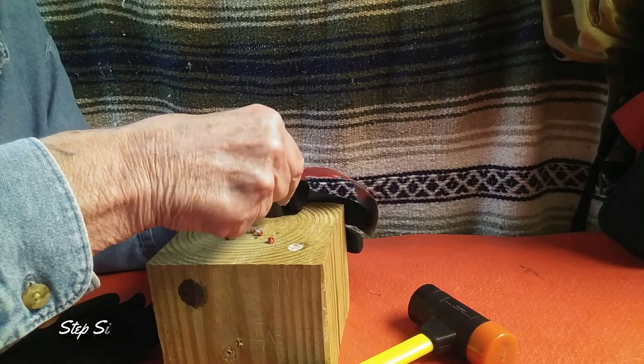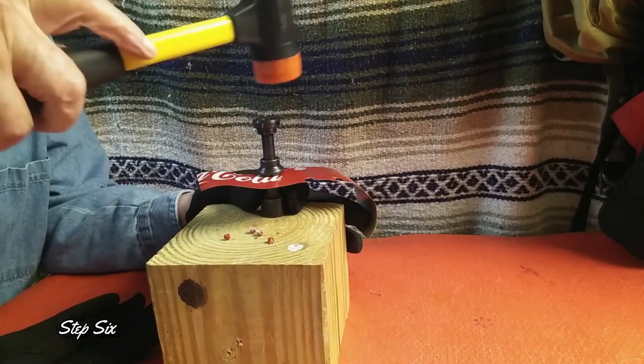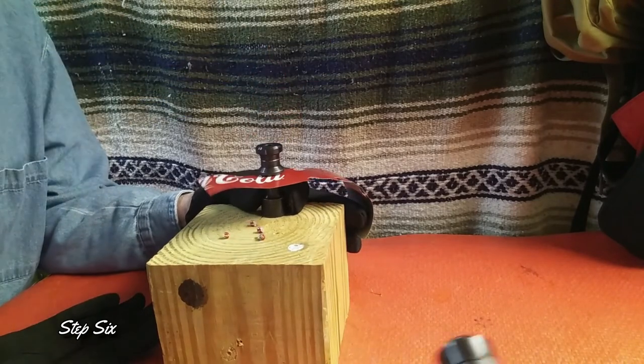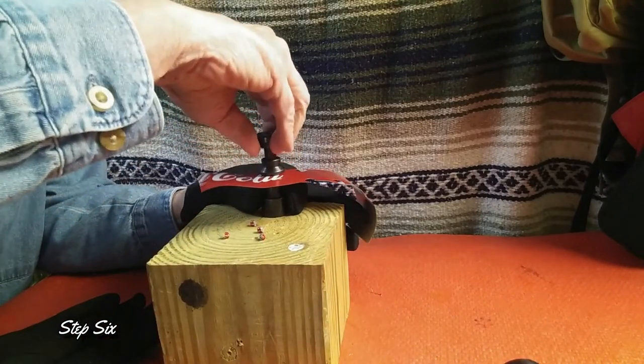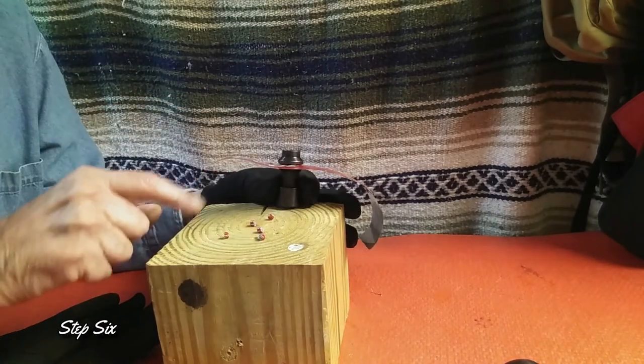Reposition the aluminum strip. For each successive cap, avoid cutting into a previously cut hole. And after repeated use, paint, aluminum, or other residue may collect in the punch teeth and should be brushed out.